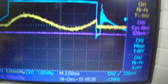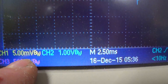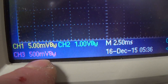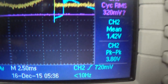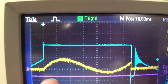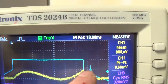Let's look at our data one more time. Our current sensing resistor is on a 5 millivolt division — keep that in mind, very important. We have 500 millivolt divisions on the third channel. Our second channel, which is the voltage, has 1 volt divisions. As you see, we have basically two divisions from the zero line, so we're sending two volts in. This is our on-time.